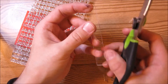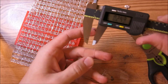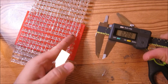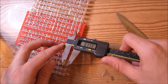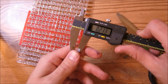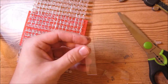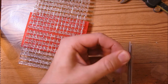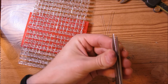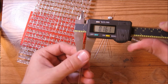With scissors, cut very thin strips of plastic — about 0.2 inches in width, because they need to lay in here and the width between sections is around 0.225 inches. Cut strips of plastic that are about 0.2 inches to fit in here. A little less than 0.2 inches is okay.